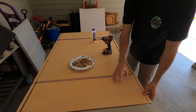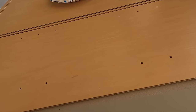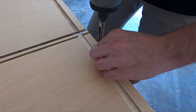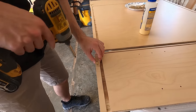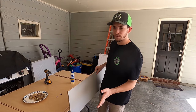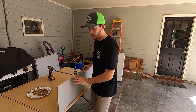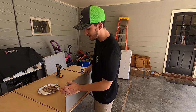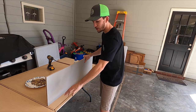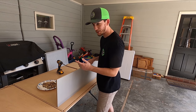We've got our two sides — these thin pieces on either side with holes drilled for the shelves — and our back. We're going to go ahead and put the clips in and pre-screw them, but not tight — leave them a little loose. We found it easier to put in the bottom and top pieces first. That way you can wrap the two sides around the piece and everything lines up and locks into place. So we're going to glue this dado and then use the three little black screws they provide and screw it from the back.